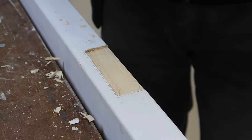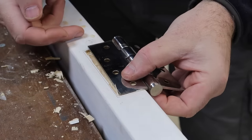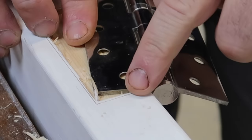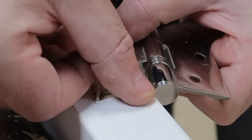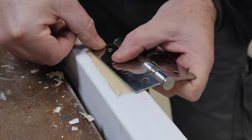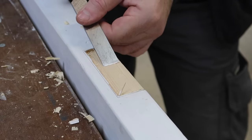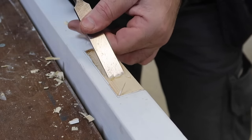Let's offer up the hinge and get a feel for the depth. I can't get it fully in yet because material still remains, but offering it half in I can feel across the surface — I'm pretty close. The hinge is still slightly proud, so there's just a little bit more to take off before we start looking at finishing the perimeter.